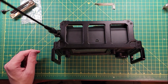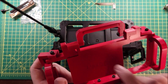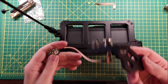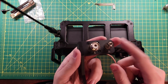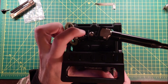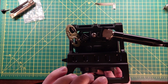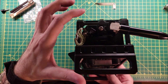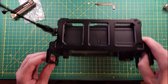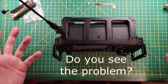I do like the Hamgear 3D case. I haven't really decided which one is better or worse — and it isn't a fair test anyway because this one is aluminum and this one is 3D printed. This one's red, so it's automatically better no matter what. But there you have it — the RC2 versus the RC1. I'm going to miss this ground screw because I use it for counterpoise all the time, but there's no reason you can't back it off a hair, stick a spade connector in there, and you're good to go. Maybe do what Ham Radio Dude does and use a spade connector with a flying Anderson PowerPole connector for your counterpoise.